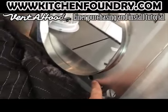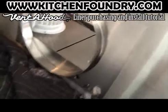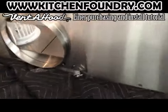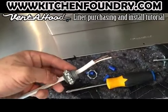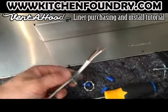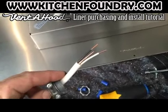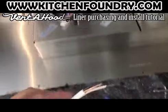Now you're also going to notice up here these two tiny holes. These are air holes for our two vent hood motors. We want to be very cautious when taping down the collar to the top ring because we don't want to tape those air holes over with metal tape. So here's what that would look like. Your Romex, you have two Phillips screws, you tighten them down so that this Romex is going to stay in place for you, and it's going to feed into this junction box where we make our electrical connection.